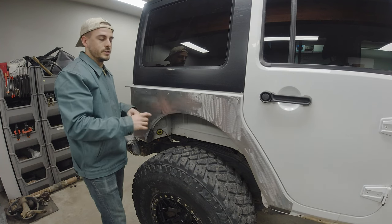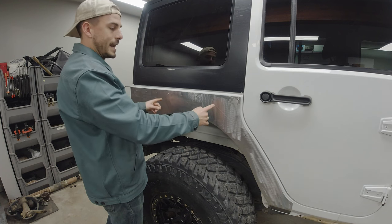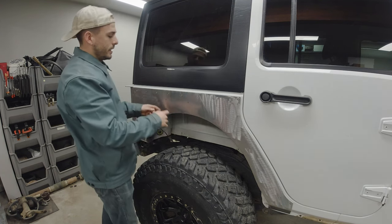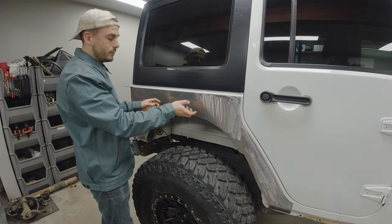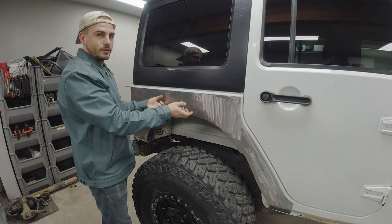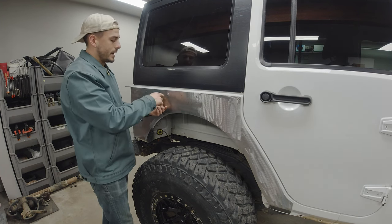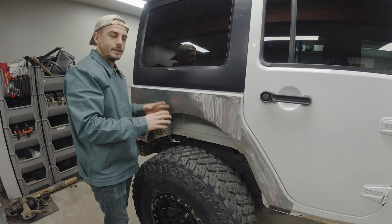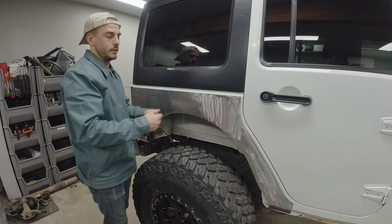The one thing I'm doing differently this time: rather than welding both posts completely before checking, I'm going to tack one in, then bring in the connecting tube to verify that location is correct before tacking in the second post. This double-check will make sure I don't end up with too large a gap or too tight a fit for the connecting tube.